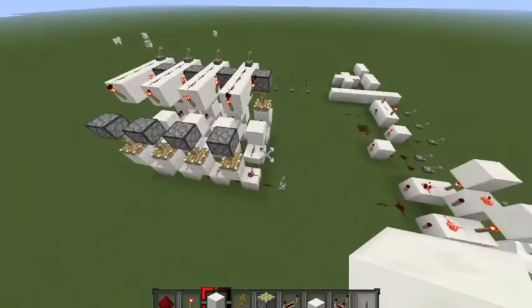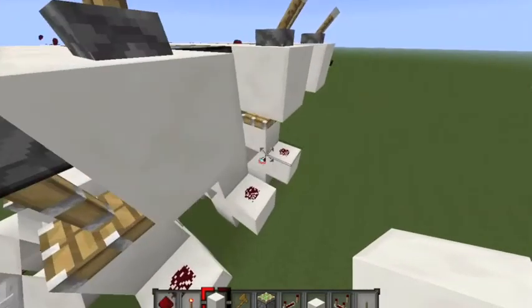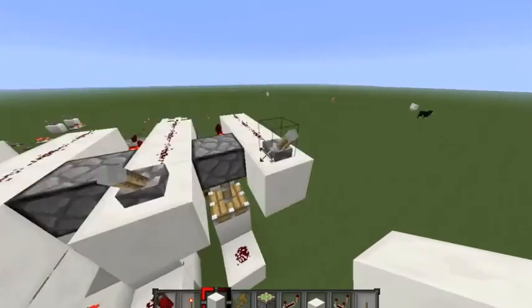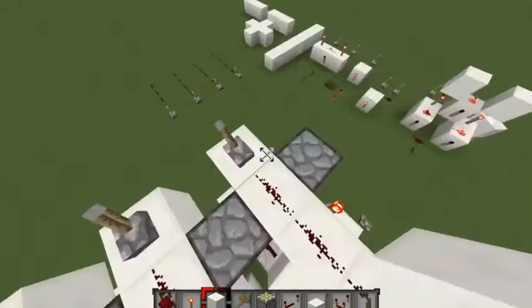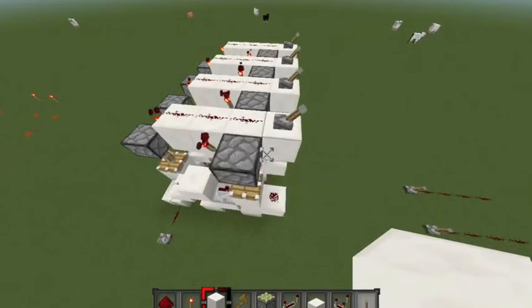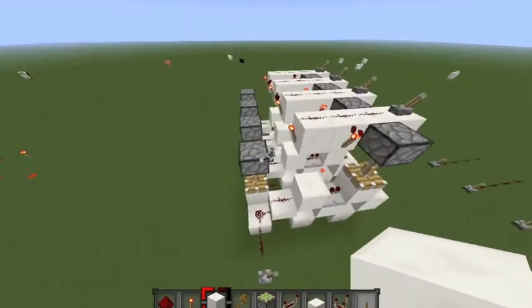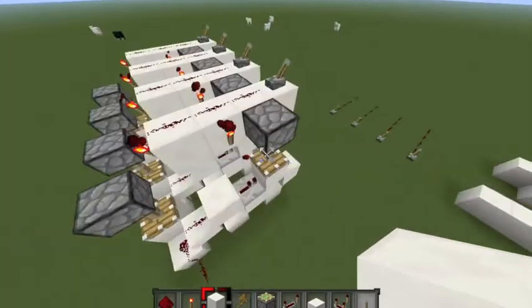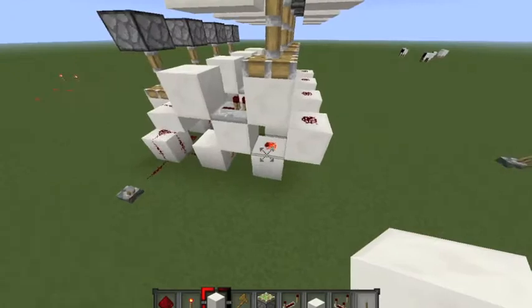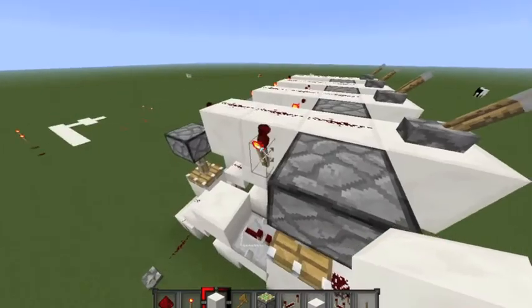So now we have our first incrementer. This can actually add 1 to stuff. Sorry if it's a bit confusing. I'll try to make my explanation of adders, which might be a bit easier for me to do, a bit more understandable. But basically, it passes the signal through if it's on, and then it uses the XOR, well, XNOR that has an inverted input.